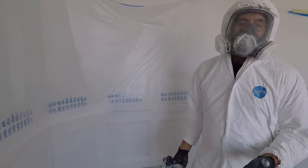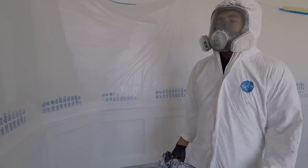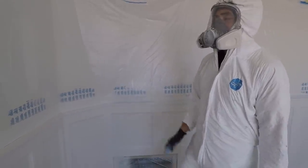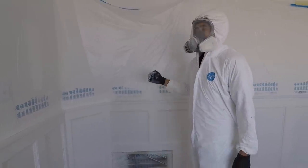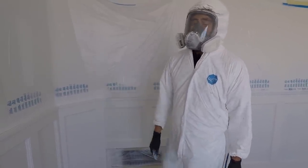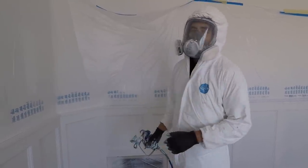It's a big problem where you have to wait for things to dry, sand them down, and then respray it again — which is just killing your time. Making these mistakes you can learn the hard way and you'll never forget, but if you can learn from me, even better. Because I've done that a lot. I said one time, 'I'm going to just lay this on here so thick, it's going to be such a smooth, chilled-out finish.' No — it just all drips. You've got to find that sweet spot where you can pass everything, cover everything, be quick about it, and don't pass the same areas twice.